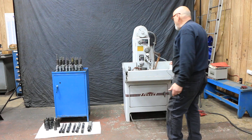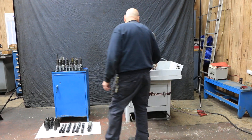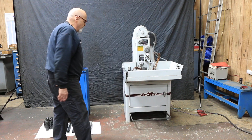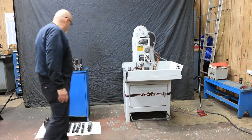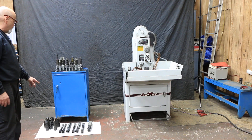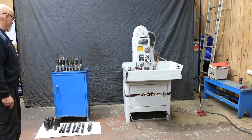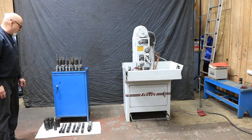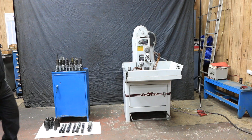The basic machine has your spindle here. In this case we have a mandrel already set up with stones and the shoes. We also have the truing sleeve for that. Down here we have a couple other large diameter hones plus several different size ranges. That will be written up on our quotation. Also some truing sleeves and the cabinet for it.